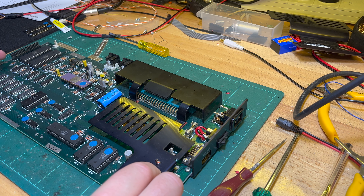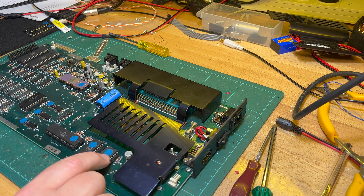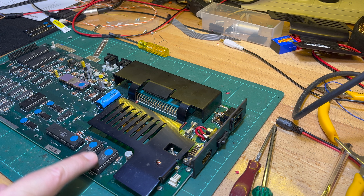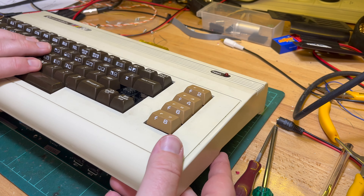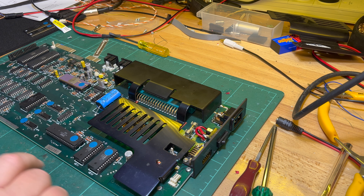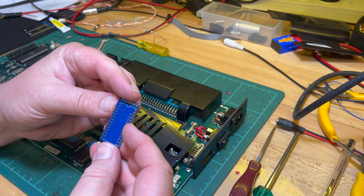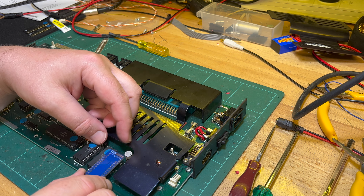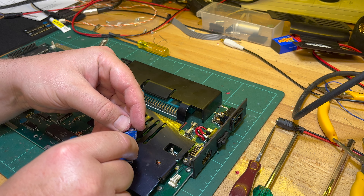That's done. Depending on the type of keyboard you've got, you've got to be careful of how high this sits - I think that's going to be a problem with the PET-style keyboard coming down. I think there's just enough space as it is, so if you stick on this replacement it's going to be sitting at that level. If you then put a socket on this and an EPROM in that, it's going to be too high.